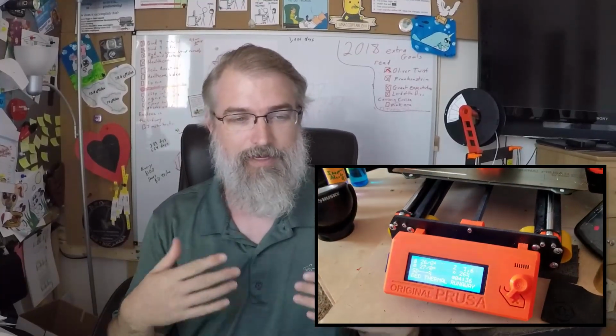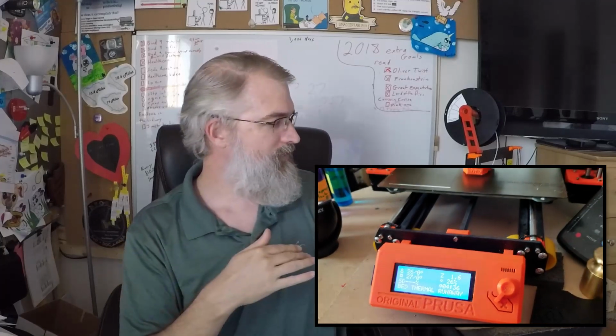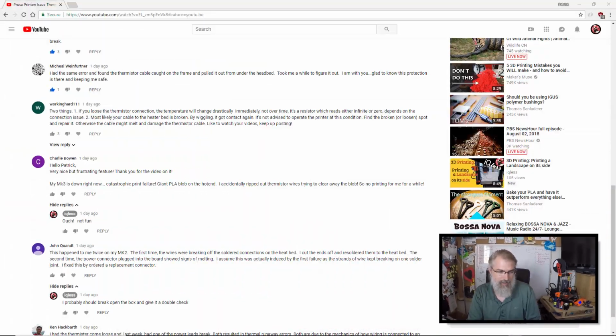And actually, what I did, I let it sit there for a bit, and then I moved it around and turned the Prusa off, turned it back on again, and then the bed thermal runaway went away. And then I went to start another print, and within a couple of minutes, bed thermal runaway again. So I'm glad I posted the last video because I got a lot of feedback that basically said what I just rediscovered again. There's still an issue.